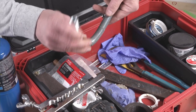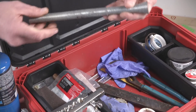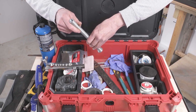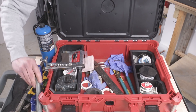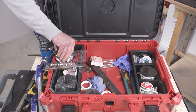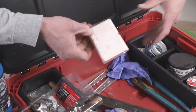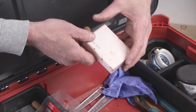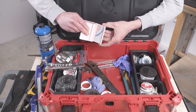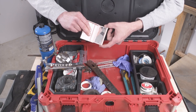This is for bending hard copper supply lines. You put this over and it prevents you from kinking the tubing. They come in a bunch of different sizes but this is the one for quarter-inch, which is quite common. And this is fun — my wife gave this compact mirror to me many years ago. I use the mirror to check the backside of copper fittings after I've sweated them, to make sure the solder has made its way all the way around.